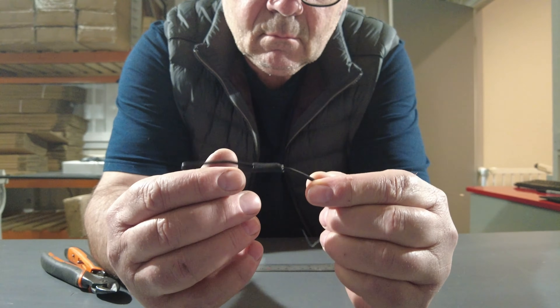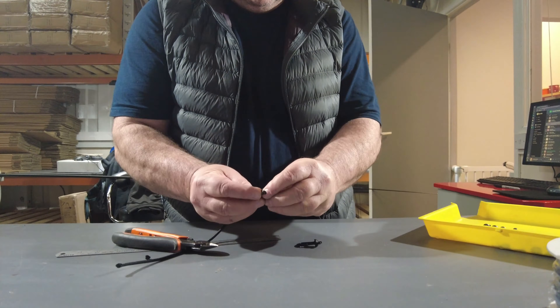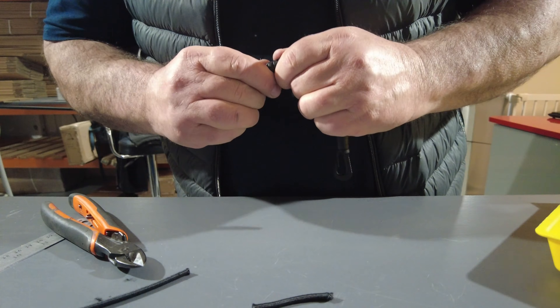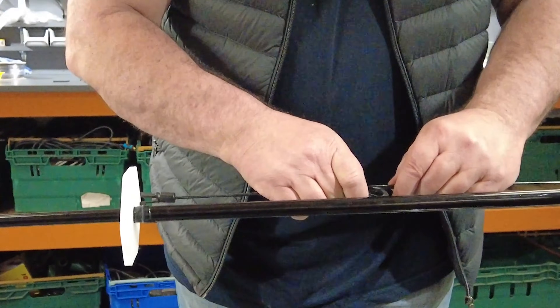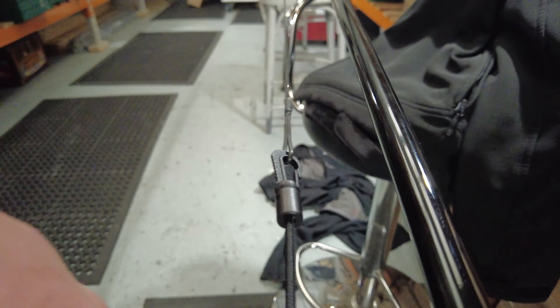I've calculated a six centimeter loop on this antenna. To keep the elements nice and taut we use 4mm shock cord — just under a quarter of an inch. Slip it over a little ferrule, put a knot in so it doesn't come off, then clip your carabiner together. When clipped you can go to full stretch on Marlow's shock cord and it should never come undone. Marlow's shock cord is so nice that on mine I've literally gone to near-maximum tension — they're very taut. Once you've got six elements pulling that hard down on the pole it's going to have the inclination to collapse.